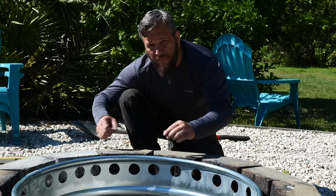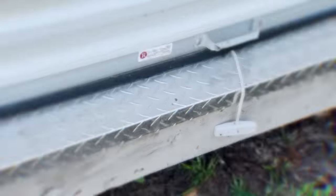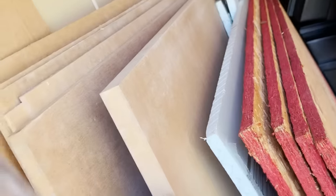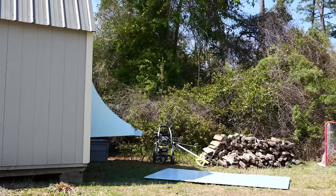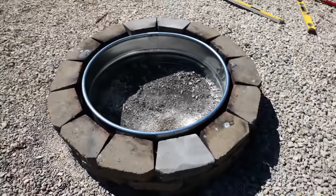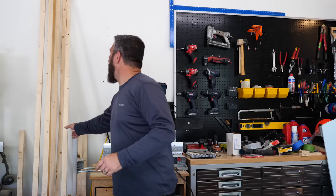Because I tried to save money and use my existing bricks, the standard caps won't work. What I'm going to do is make my own custom coping — basically the cap that will go on top — and I'll show you it's very simple to do. I think I have some blue foam back here, and I do. I know that the outside diameter for my cap is 56 inches and the inside I want to be 34 inches, so I'm going to take a piece of this drop piece.